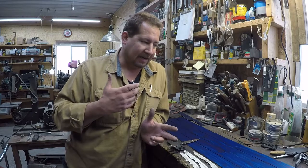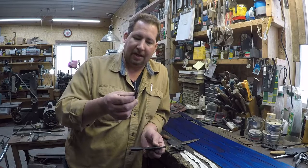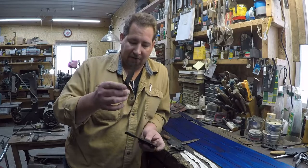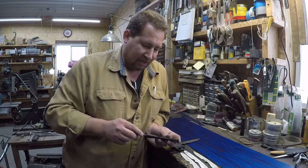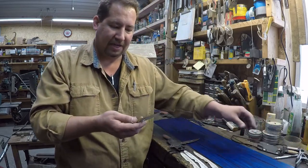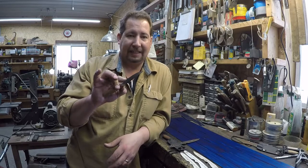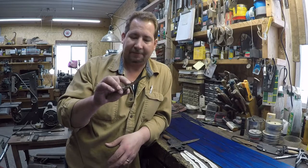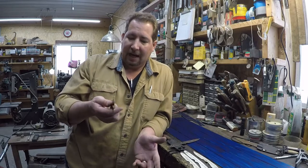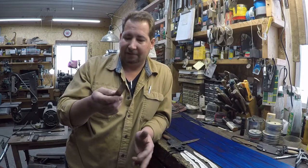Now remember I told you about my neck knives. This one was a forged pattern welded one, so the thickness will be run slightly thicker on these. But on a normal neck knife, yeah, this one, 1095, I make these out of 16th inch thick stock, and then I put a very lean grind on them to get most of the weight out, while still maintaining a usable level of strength. And 16th of an inch is fine for me for that neck knife and that class of knife.